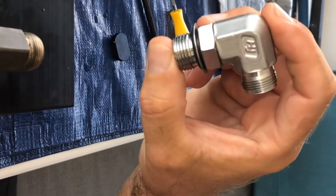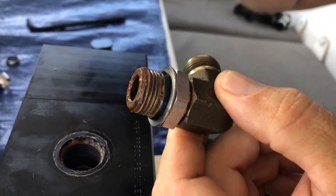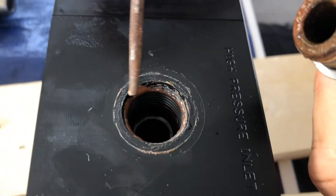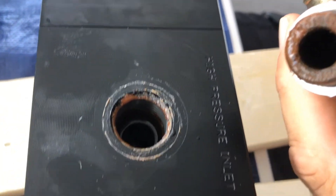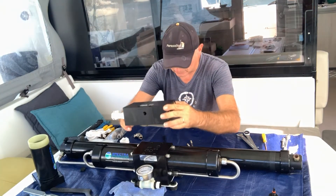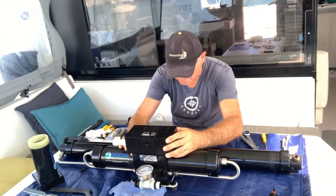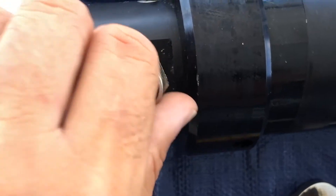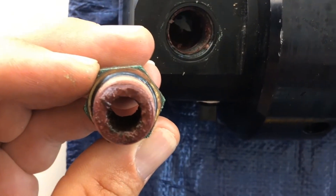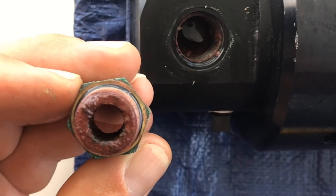These are very good stainless steel compression fittings. All this corrosion is going to end up in the Clark pump, in the membrane, and maybe it's going to score the cylinders. Now you put the pressure intensifier on the Clark pump. Look how much corrosion there is with these nickel bronze fittings — all this goes into the membrane and shortens the life of the membrane.